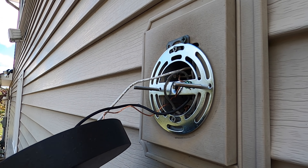Let me turn the light on and we'll see what happens. That's the complete fixture installation, almost — except for that little bit of caulk work up there because this mounting surface is a little warped from the heat. A little blue painter's tape on there, do a little caulking, wet your finger and smooth it right in there — you'll never see it, and that'll keep this good and waterproof. I have one more to do, but I won't bore you with that. We'll see you on the next one.